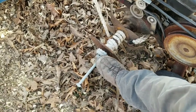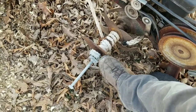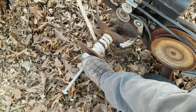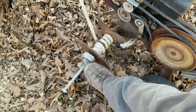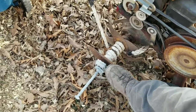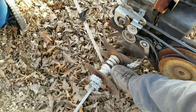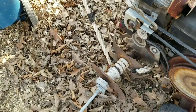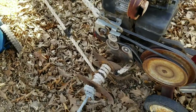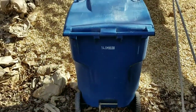And I've got two utility anchors, or down guy anchors, that I've screwed into the ground. And I've run a machine bolt through the anchor with a couple washers, and the tip of that bolt runs into the tines of this tiller. So I've got it on this side, and also I've done the same thing on the other side, and that anchors the tiller down.